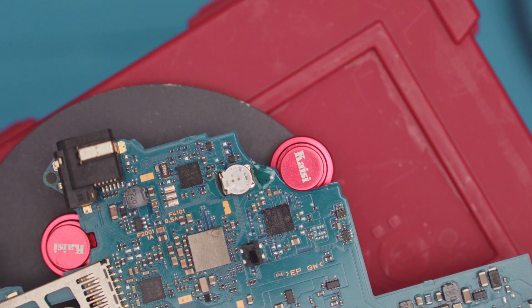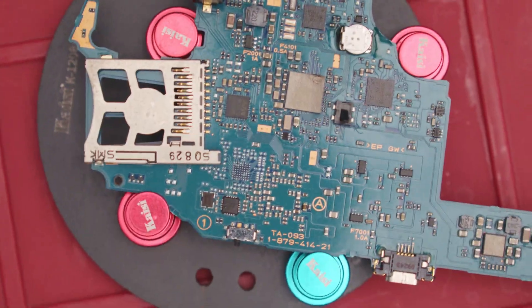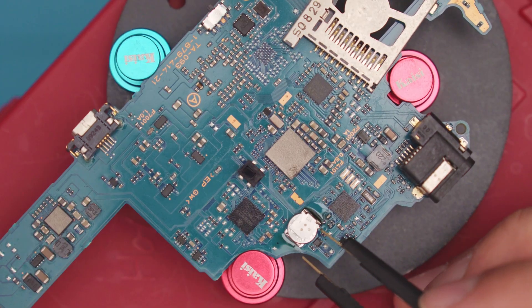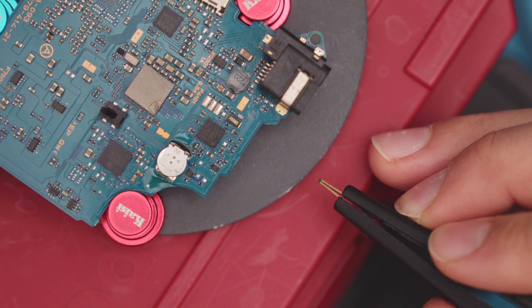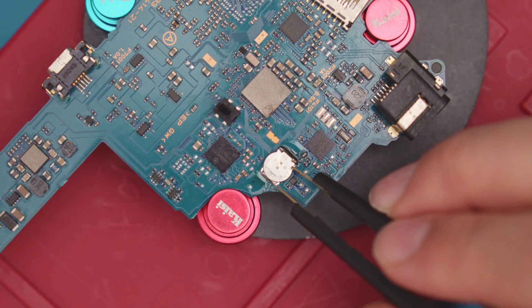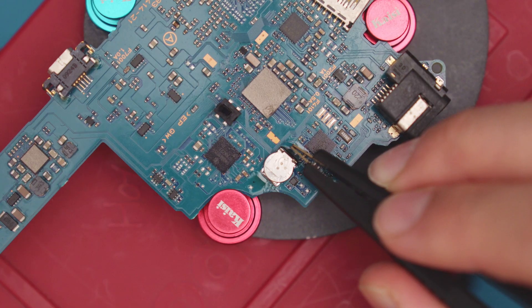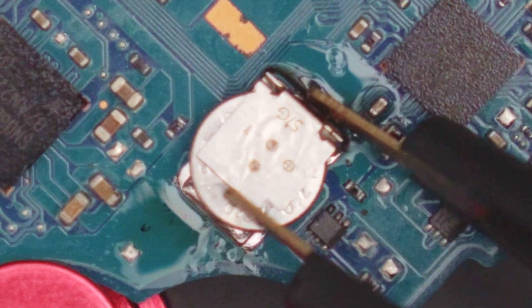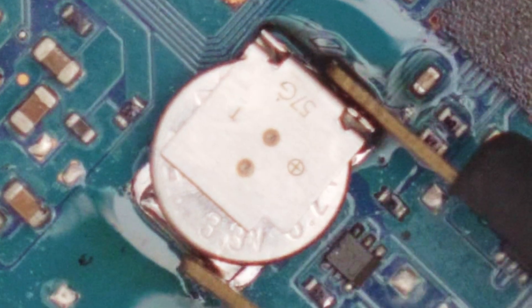I think that did the trick. Inspecting it visually, we can see that it's not touching. To confirm, we grab the multimeter, switch it to continuity mode, and see if we get any beeps. If you touch these two contacts together, it will beep — meaning there's a short circuit. Just keep in mind when doing this test that the entire body is linked to the inner side. When we go ahead and try it out, we can see that there is no continuity.